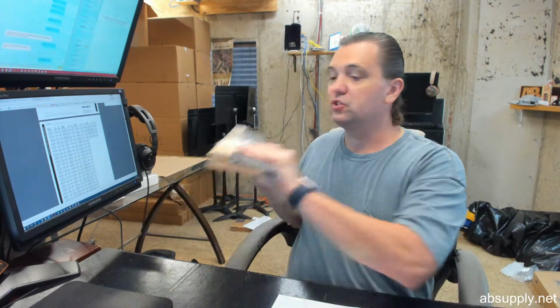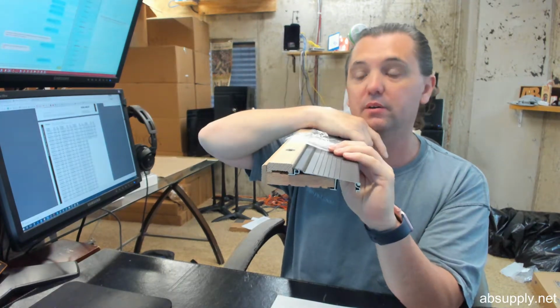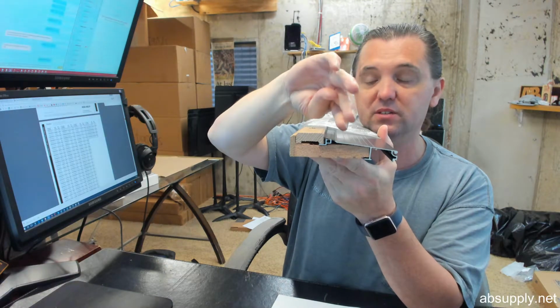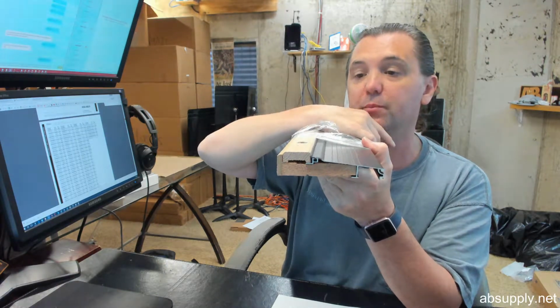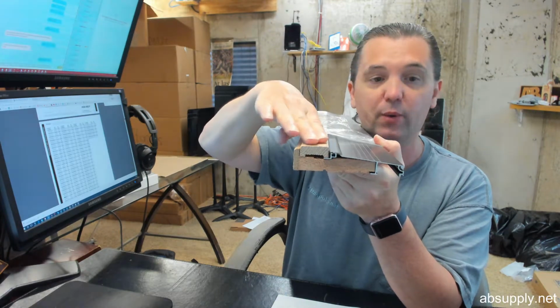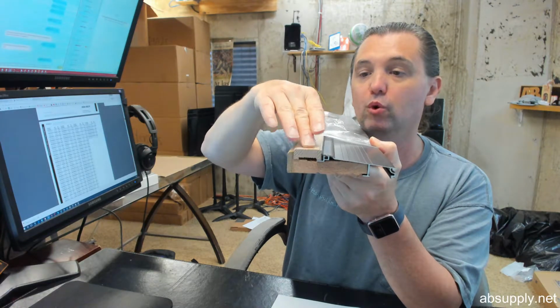This is an in-swing threshold, so you're going to have a condition by which the door is going to primarily reside over this area. It'd be very much recommended that you have a door sweep, even one with a drip cap that would be attached to the face of the door, or even better, perhaps a mortised automatic door bottom underneath the door so that it can make direct contact with the top of the adjusting wood trim on the top.